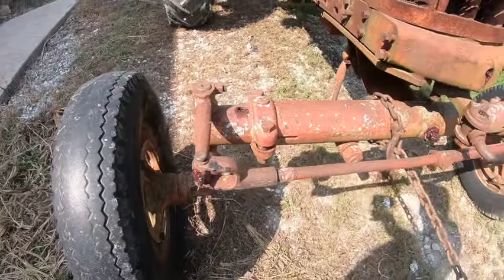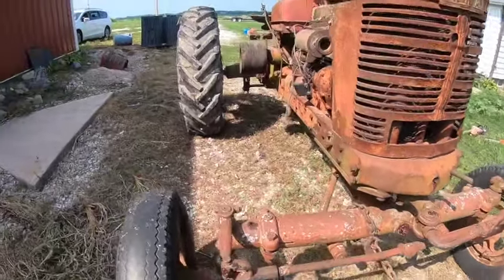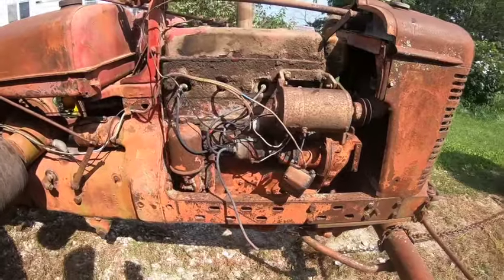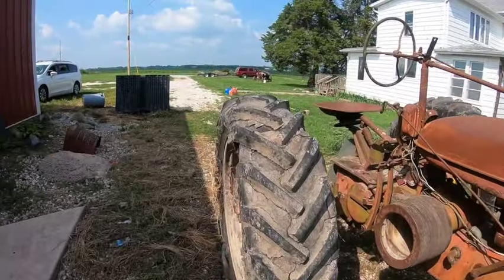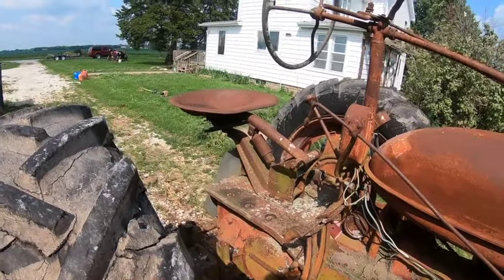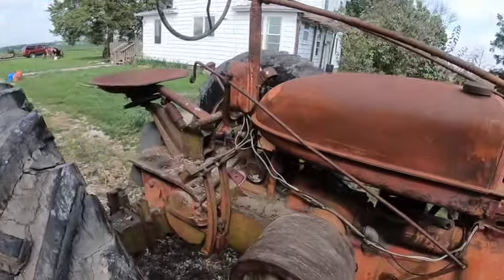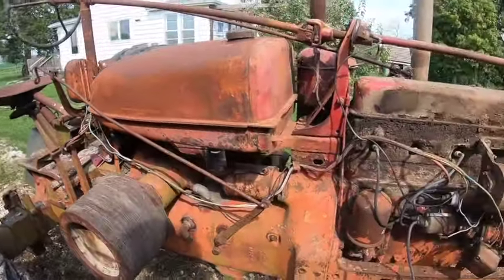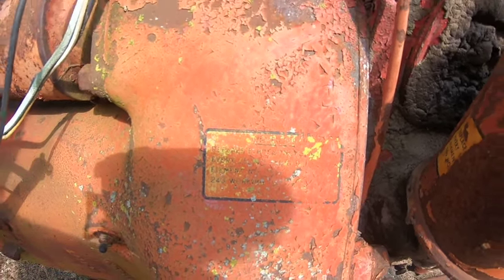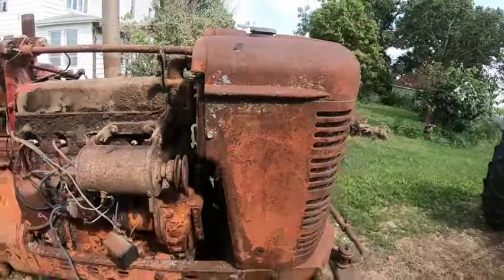The first thing we've done is go through and hit all the major grease points on the wide front, since that's pretty much what I wanted from this tractor. Everything moves and I don't see any nasty cracks or welds. The angle braces are missing but I think we can fabricate those. This thing has done a lot of sitting — the tire is shot, the rim may be salvageable. The seat is one of my preferred seats but it's going to need new bushings, a spring, and a shock. It does have a paper pulley but I sure wouldn't want to spin that. One neat thing is I don't think this tractor's been painted for a long time because it's still got some cool stickers left on it, though one unfortunately you just couldn't read.